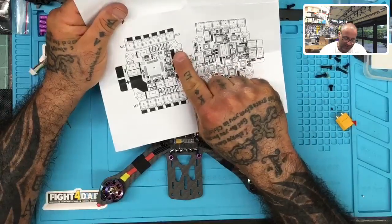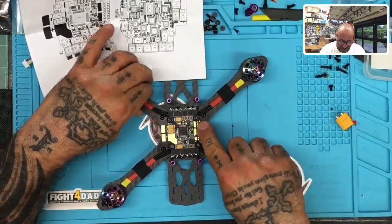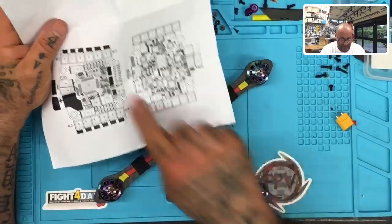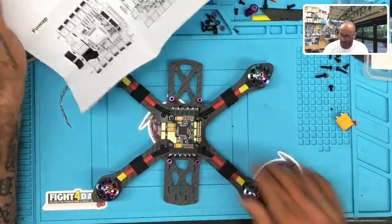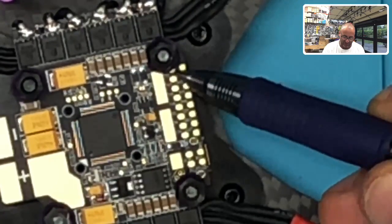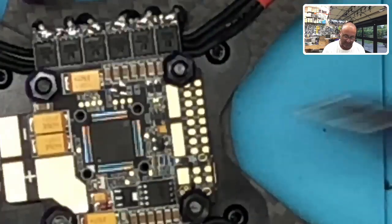The screening of the pad is below the pad and not above it. It gets really confusing. I know when I first looked at this, it was confusing. Not to mention that TX1 is way up here. That puts it above the wiring and under the spacer, which sucks. But luckily, we don't have to worry about that. We are using RX1, which is open. So let me show you how much room I got. Look, see that? Yep, that's TX1, and that's RX1. Thank you for not swapping these two, or else this would suck right here. So I am going to tap onto here.